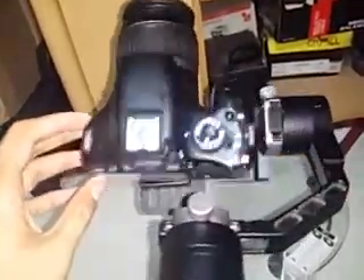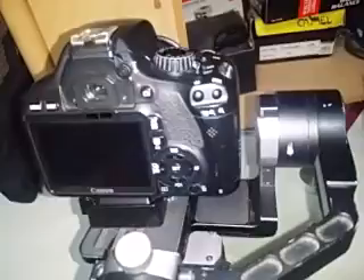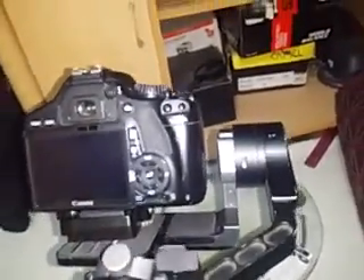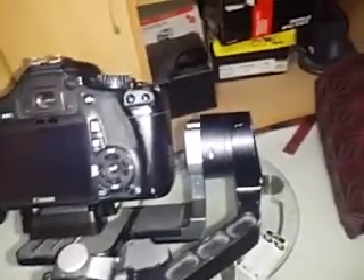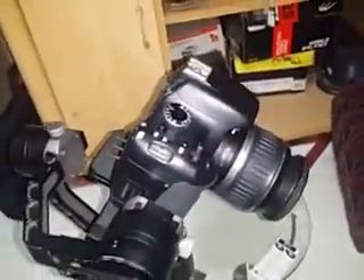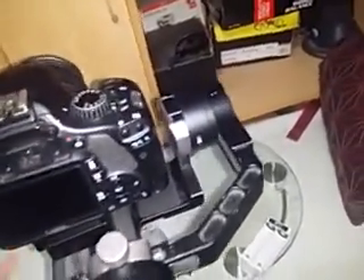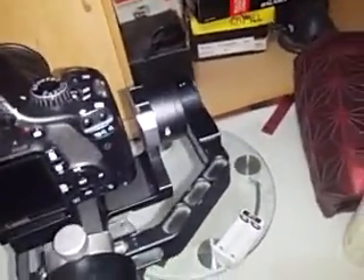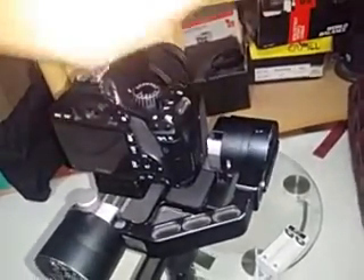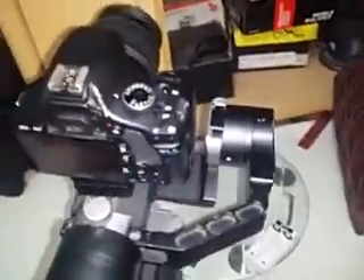I have a pretty good guess it's software-related, because I discovered that in the old firmware, if I placed it in lock mode at certain angles and pressed it all the way down, it would just shut off. If I turned the pan to about 1.2 times its range, it would shut off. If it were a hardware issue it would fail at any angle, but it consistently needed a full turn plus 20% more before shutting off or entering standby mode — that was happening in firmware version 1.4.